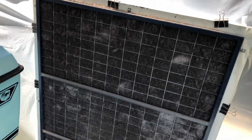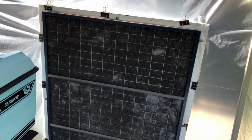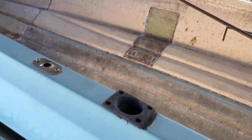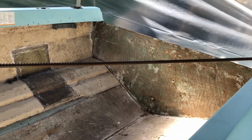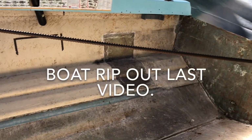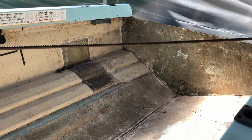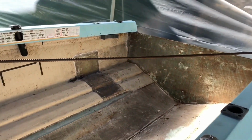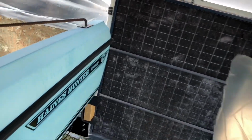So I will get the glass into it, and whilst I'm masked up, I will empty that out and chuck it out. But anyway, all the bits and pieces are cut out of this. The transom's all scraped out, came out like wheat bix, paper mache, and I've got to grind off all of this gel coat so I can start laying a few more layers of glass to put a bit more strength back into it. Anyway, there you go. I've just turned that on. All the sides of this tent are bellied in because it's a vacuum in here now.